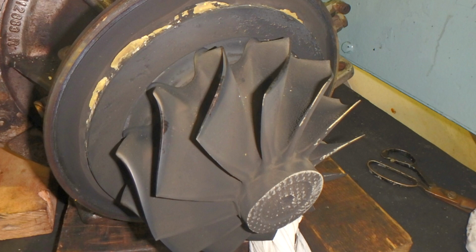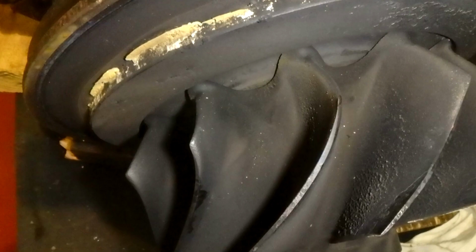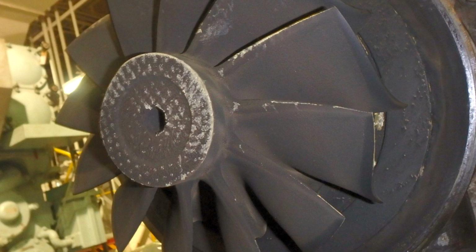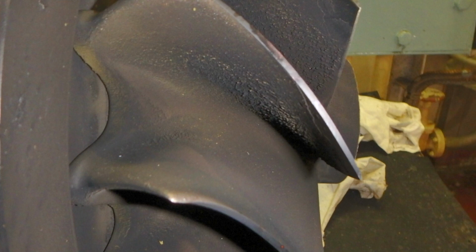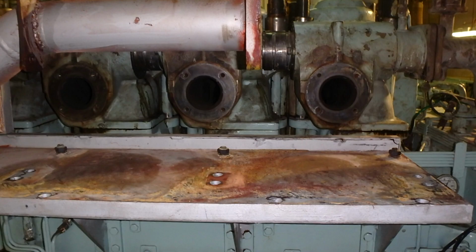First of all, with this turbocharger, there is a need for cleaning of the blades. There is accumulated sulfur on the blades, on the inner parts, and these blades will be placed in the soap. It will not be immersed totally because there are bearings inside and we do not want water to enter the bearings. Just the blade will be lowered into the water and mixed with soap, so next day everything will be removed by the water. All the impurities will fall down. Never immerse the whole turbocharger in water, because you will have corrosion on the bearings, the floating bearings that the turbocharger has.